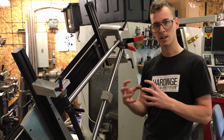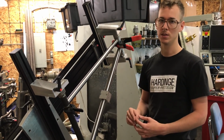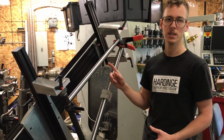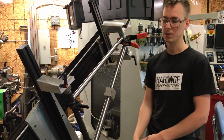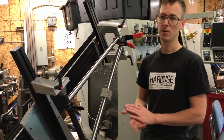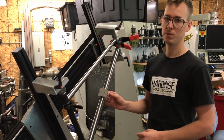You'll see this scaling, people call it fish food, but it's like a discoloration, and it looks really bad on the inside, and that's a sign that the weld is definitely compromised. On steel, you don't really need to back purge, but it's not a bad idea. It helps you create a nicer, cleaner weld on the backside. Some people say welding on the outside goes easier. And then you have sort of the middle ground where you have really fancy alloys of steel or stainless steel, where you really should be using back purge.